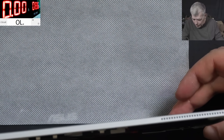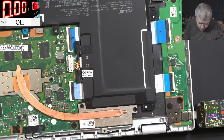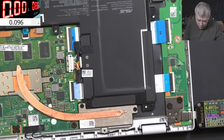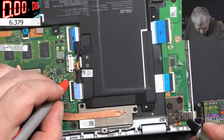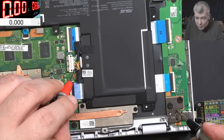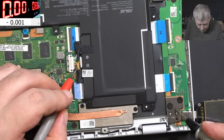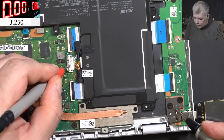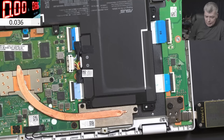Let me try to press the power button. Probably nothing will happen. No. So which is plus and which is minus? Probably if the first one is minus — the first pin is like 7.7 volts, 6.7, and it's black. You can believe that? It's a black wire here. So the black wire is actually plus, 6.8 volts. I mean, they don't even care about the color.